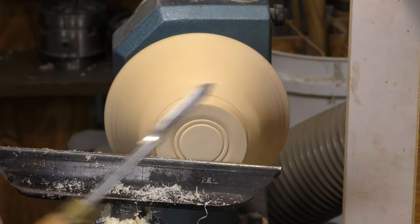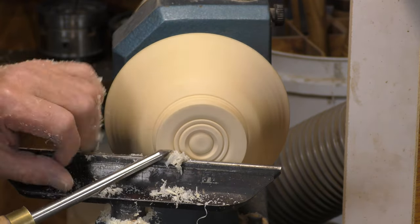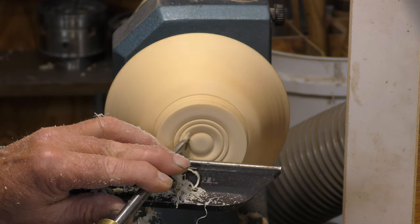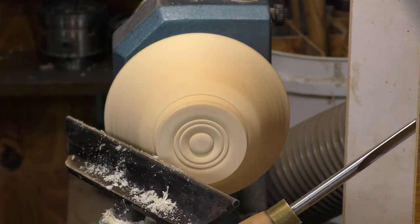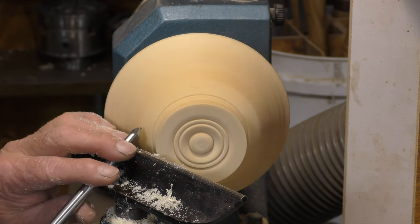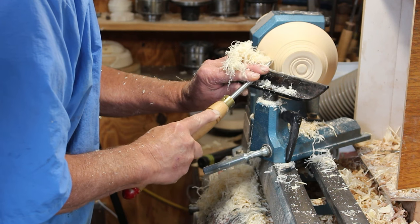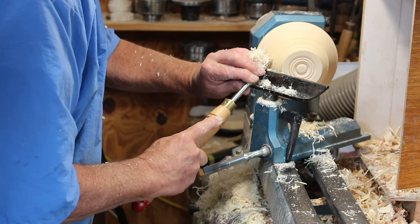So I want to make a big bead in the middle. I can just start at the center and pivot the edge, bevel riding more or less on the middle of that little bead, then into the middle. Coming up the side again — have the finger there as a kind of stop, into the wood. For a little bead, you don't move the handle much; take the handle around in a small circle. If you want a bigger bead, just drift it around in a bigger circle.